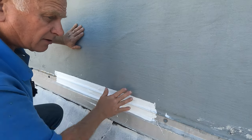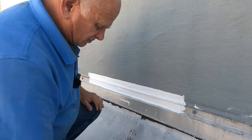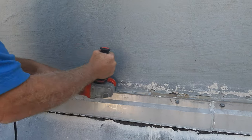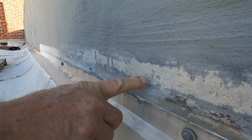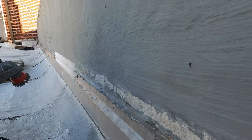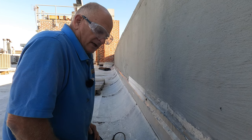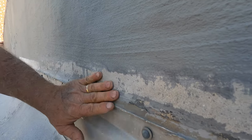This is five years old and it hasn't peeled, but let's assume it peels — then you have a problem. So it's always best to remove the paint as much as possible. This is by far better; the silicon will suck into the cement instead of sitting on top of the paint. So it's always best to remove whatever you have and get to either the metal, cement, or glass. Remove it and then you have a better chance of success.